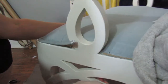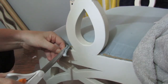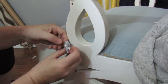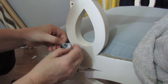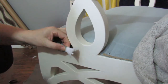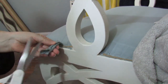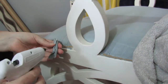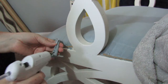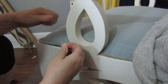I'm going to work this in just like I did on the other side. I'm going to cut it back and make sure that all fits under, and then I've just got a small length to finish off this chair. It's a little bit of patience to do this - it's not hard. I'll pull the fabric back like that and let everything else stay. I think if I take it back to about there it'll tuck in quite well underneath. Always check - by the time the fabric's wrapped around it it'll hide it. Remember to dab a little bit of glue on just to hold everything in place - not much. The glue's quite hot so you don't want to burn yourself - I did that the other day and ended up with quite a big blister on my finger. As long as that all hides in, especially on the outside, because you don't want that showing.